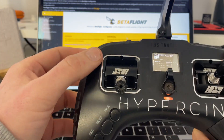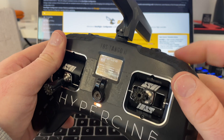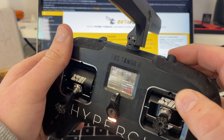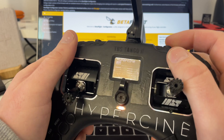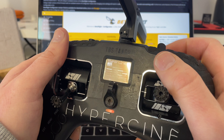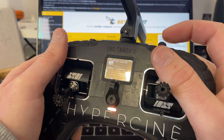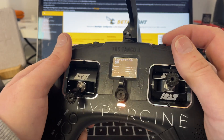How have I got this set up for my drone? On this one — this is optional — this button right here does my battery voltage. Here are my mode switches, because before we always used to have the switch up top. I like having it on the right hand. So that would be acro, that would be attitude — or horizon leveling — and sometimes return to home if I have that on the drone. So: acro, horizon leveling, and return to home.